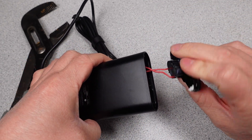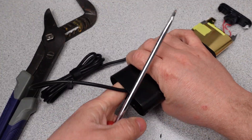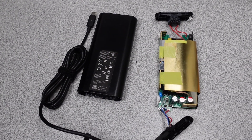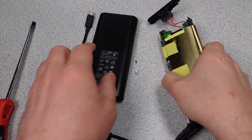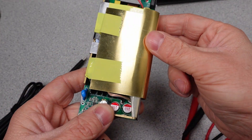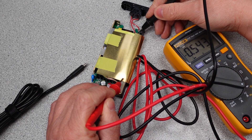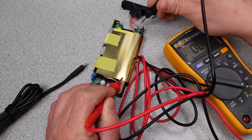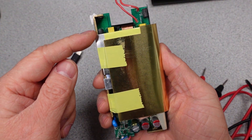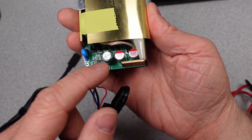This is also going to give a false sense of hope that this device is safer than it really is. The adapter looks like it is pushed in from one end and glued in place inside the plastic shell. The first thing I noticed that I don't like is that the metal shells wrap around and there is only one piece of tape between this shell and the secondary side of the adapter. It turns out that these metal shells are connected directly to the mains through one diode or the bridge rectifier. So it does have some isolation, but a sharp metal object on one side of a tape and another sharp metal object on the other side means I wouldn't trust this over time to hold isolation.